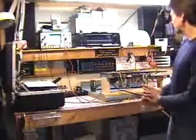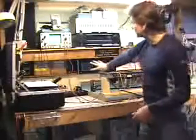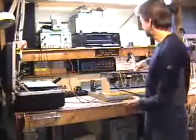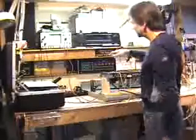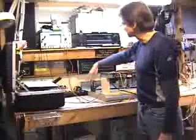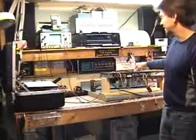Okay? So it's now going into a 4-ohm load, some resistive loads, and it's coming up to a basic monitor so I can monitor what's going into the dummy loads, and then I'll use this for more accurate voltage measurement. So I've got a signal generator generating a 1 kilohertz signal at minus 30 dB, a nice low level, going into the input stage, the bright channel.